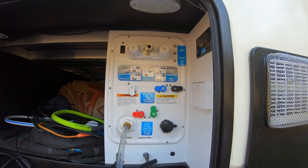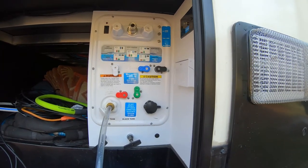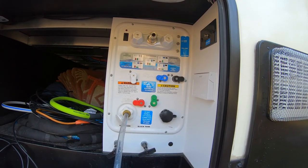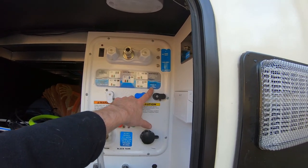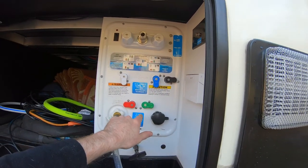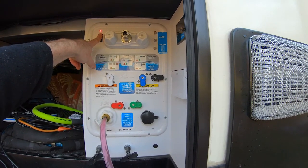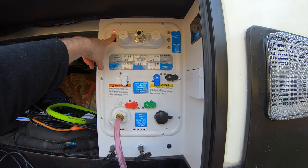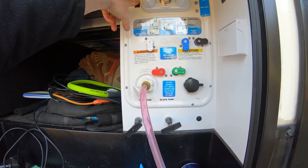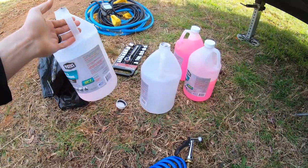After you've got that done, that gets everything through all the different outlets inside the house and different water spigots within the house and outside. Make sure you do that. Then one more thing I'm going to do is just put a little bit in our fresh water tank as well — just let it sit there on the bottom. So it's just a siphon to tank via pump. Turn your pump on and that will still avoid hitting your hot water tank. I'm not going to put a ton in there, but enough to fill up that bottom part.